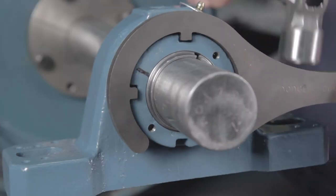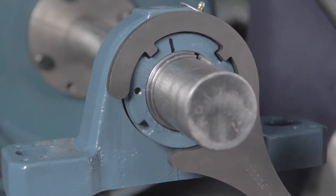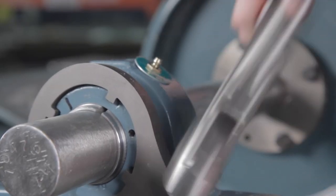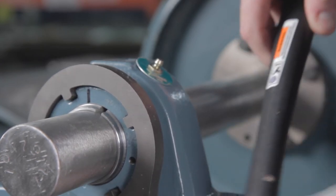It is best practice to rotate the nut to the minimum number of turns required. Using a drift or Imperial impact spanner and hammer, rotate the lock nut 7/8 to 1 turn from the marked zero reference point. Once the desired rotation is achieved, the bearing is mounted.